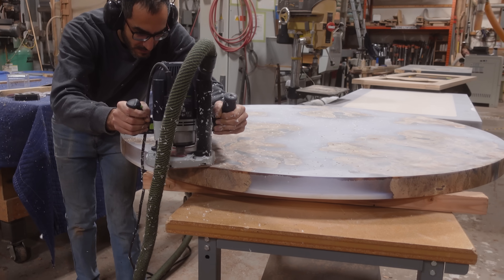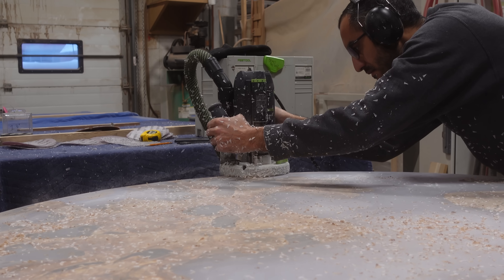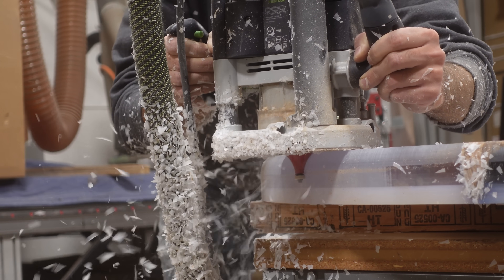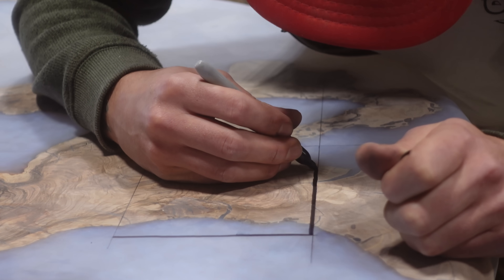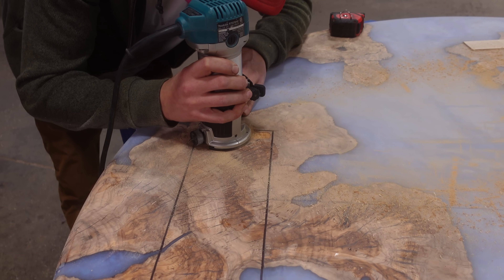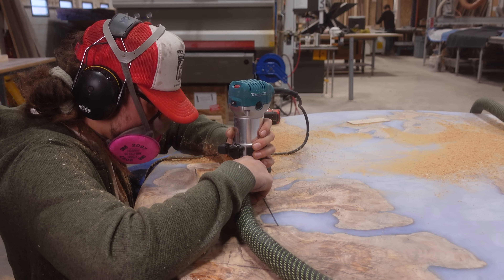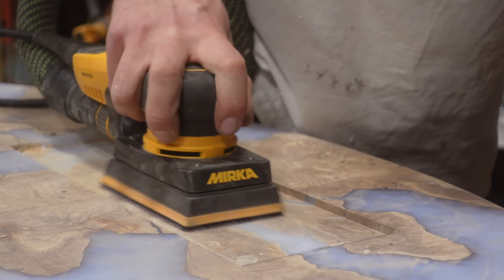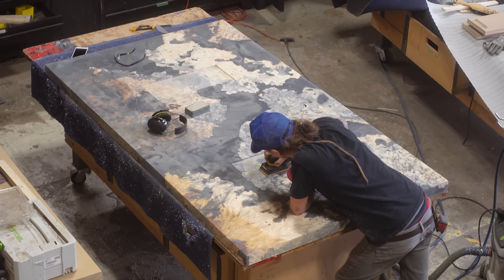Another unique aspect of this furniture package is that the client wanted a really large round over on the outside edges — again requiring multiple passes to ensure a clean cut. With the round shape of this table it gives a really nice feel and profile to the entire piece. From there we flip the pieces over and plan for the leg pockets that are going to fasten the base. Because of the irregular shapes of the wood, we have to be strategic about where we land these plates to ensure we have solid wood for the inserts. Once planned and routed out, we use our Mirka sander to sand everything smooth inside, doing the exact same thing to the buckeye burl table.